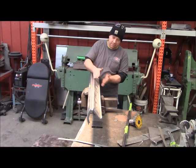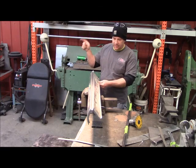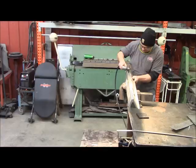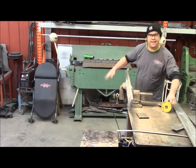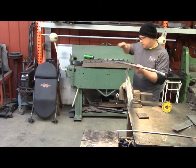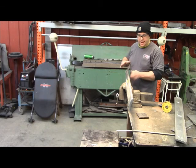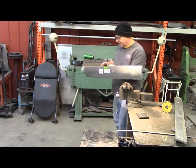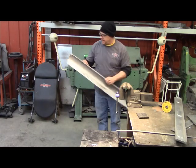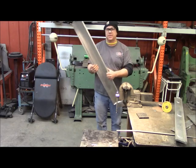I'll probably make this section as wide as possible. I also have that finish strip — I need to factor that in on the look so Mike can make the top of this that exact inner trim piece. Meanwhile, I'm going to cut this in two and then shrink on this outside — this is going to work out good. Now I've got that off. This piece I can put pretty much anywhere I want, so I'll just locate that in and make that door seal work out nicely and have those indentions in it for strength and it'll look good. I'm just going to clean this up a little bit where I've got this one cut. I needed a little more of an arch in it, so I'll just do that with the shrinker — make this just like the outer radius of the wood. I might try to stretch and roll it out a little bit in here, but it's already got a little bit of a football shape to it, so I might not have to do much with it.